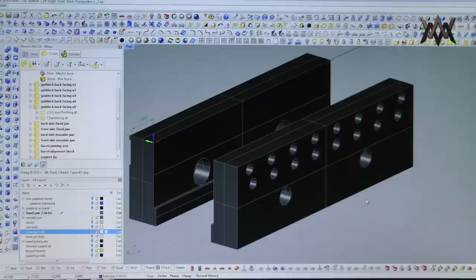And I'd like to keep everything at 8 just because that's how my fixtures are designed. So if I can just do 8 from the start and then 8 on fixture 2, or fixture 1 and 8 on fixture 2, and then milling the backs off of 8 of them, I can keep everything at 8. So that's where these bottom holes come in.